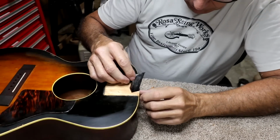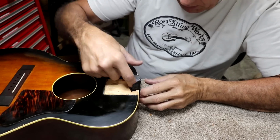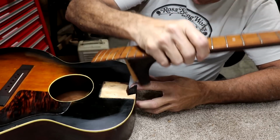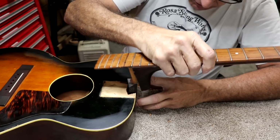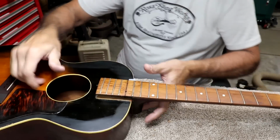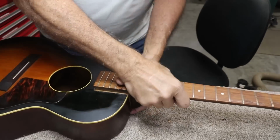For the record also, every once in a while put the paper in backwards, in other words, make the mark on the inside of the slot. And you really need to do that, because nobody says the inside of the slot's perfect either. It could have bumps and things, and you just want to see where the high spots are there too and get rid of those.